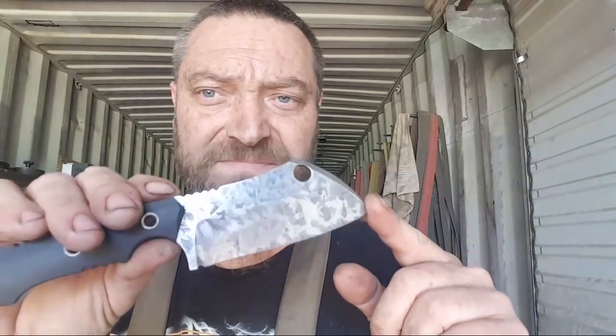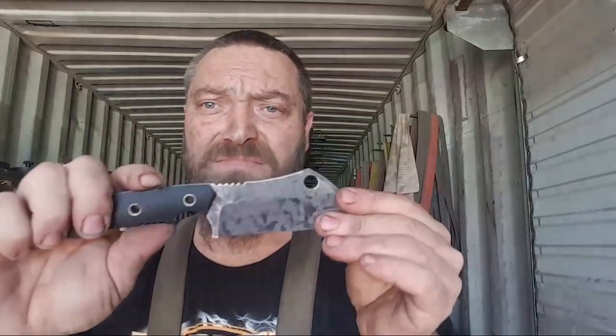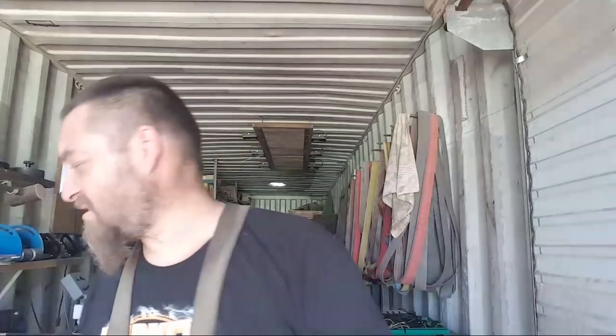It's an etch finish, but it gives a nice dimension to the blade. I don't do this often. I think this is the second blade in 2 years that I've done in that fashion. This is a prototype. I won't be making more of them. We will be making more of the design, but not in 5160. This will actually be laser cut and then 3D CNC'd out of N690. So that's the prototype. I love this knife. I had to finish it, so make it a once-off, and there we go. So that was the surface finish.